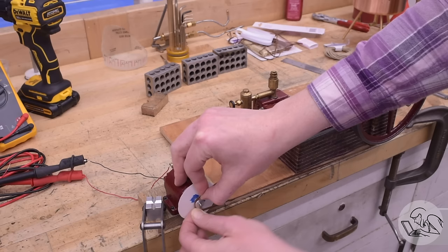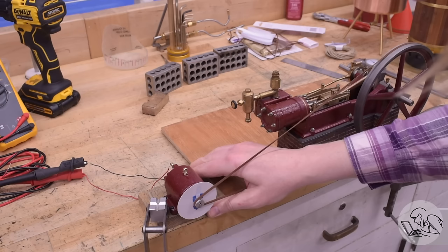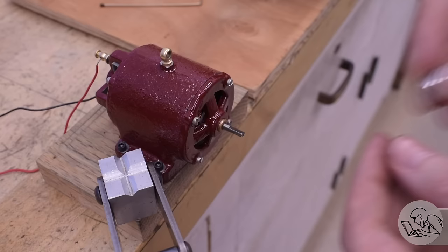The two things we need to figure out are belt tension and whether this stuff can drive the load without slipping. That's why it has to be a little bit stretchy but not too stretchy — rubber bands make terrible drive belts because they are too stretchy. With this arrangement I can easily tweak the tension and alignment by moving my clamped pieces around on the bench. With the right tension it drives the load really well. However, the belt tracking is not very good — it doesn't like that round groove o-ring pulley I made for an o-ring, obviously.